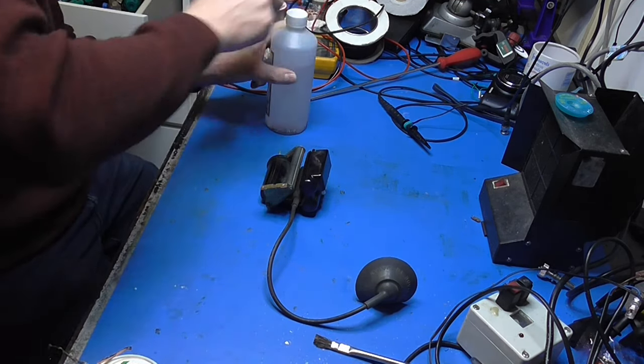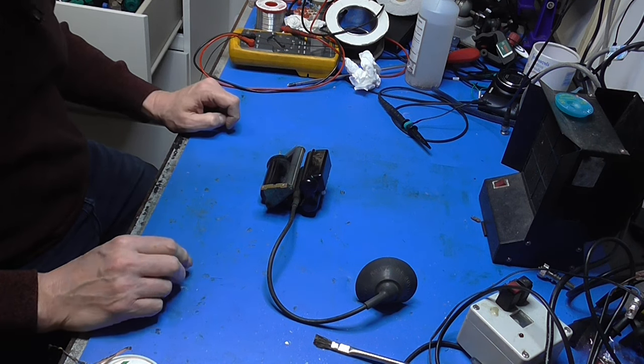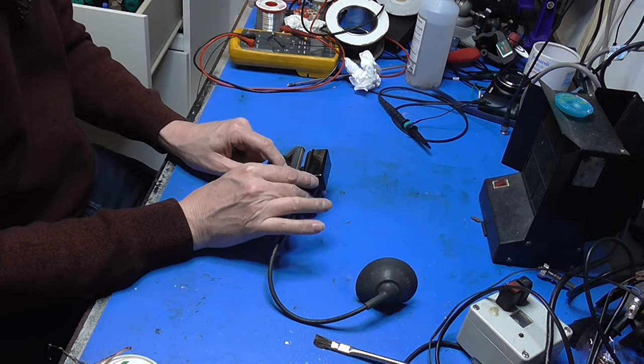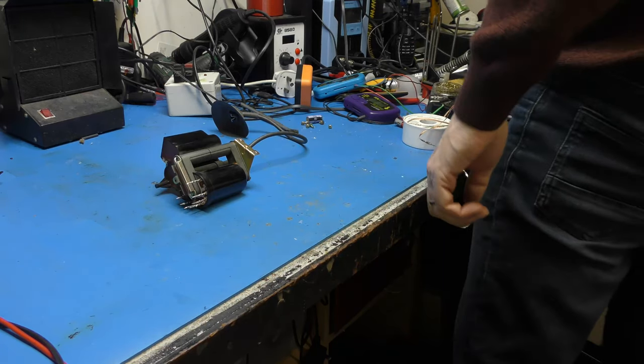Our EHT comes out before that, so it either comes off the bottom of the rectifier maybe, or maybe it's a sort of resistive divider VDR sort of thing. I don't know, because we have no data. It could be EHT, but I don't think it is. I think it's more likely to be down at sort of 6,000 or 7,000 volts. So whilst it's still got enough to leap out, I don't think that damage is severe enough yet, hopefully, fingers crossed. So what I'm just going to do is put some Araldite across that crack, if I've got any. It's just a two-part epoxy.